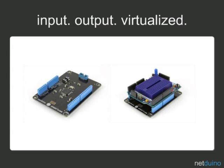Well, you only have like 64 on the Netduino Go, yet we might want to be able to plug in 100 or more different digital inputs or analog inputs. Let's say we're not satisfied with just 6 analog inputs. We want 24. Well, with Netduino Go, you could plug in 8 3-analog input devices, or one that had 24 on it. Here's the shield base, which looks a lot like the classic Netduino and Netduino Plus, and it gives you those 20 digital inputs, outputs, 6 of which are analog inputs. You simply plug it into the Netduino Go, and now you have those same kind of capabilities.